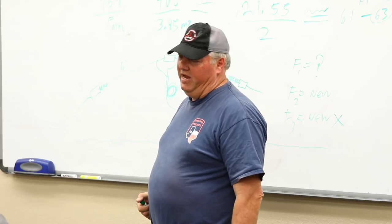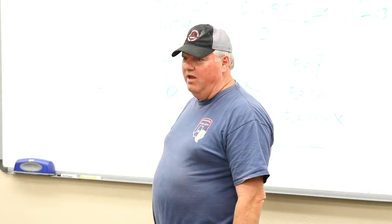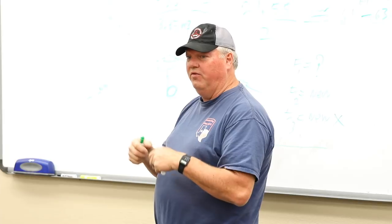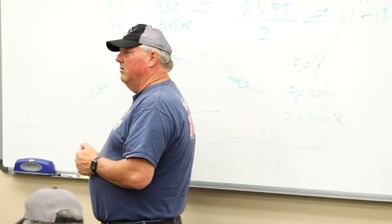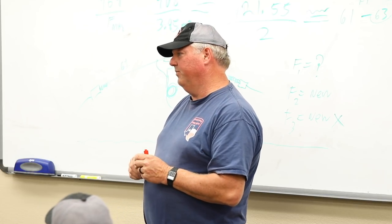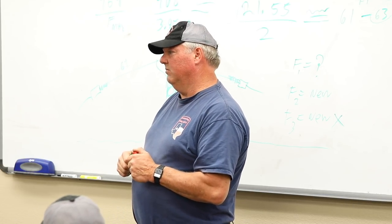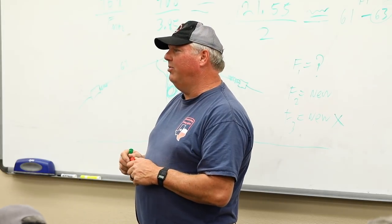So based on the frequencies, and you can look it up in the ARRL antenna books, they give you recommended diameter and number of turns for the frequency. And then they give you one that made about 21 feet around a piece of PVC pipe. Yeah, that works too. Except the only problem is we ended up putting it up next to the mast. You know, the mast coupled into it.